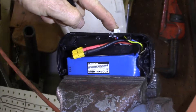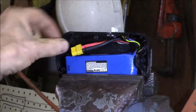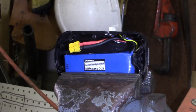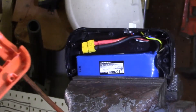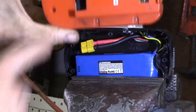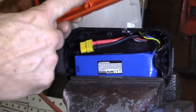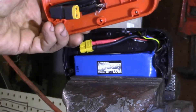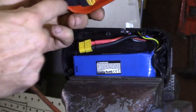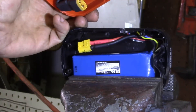I'll be able to plug the battery charger in and plug the power cable. This will be plugged into the main battery pack. So this is the top of the battery — this is the part that slides into the Black & Decker power tool. I've got a 10 gauge wire soldered onto the two connector tabs there, and then it comes around to an XT-60 plug.